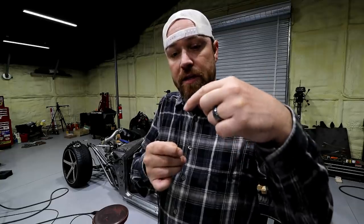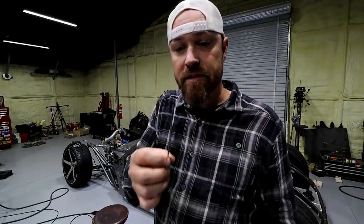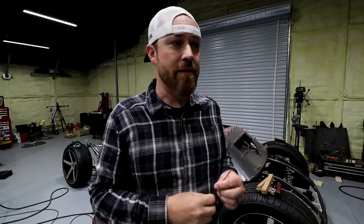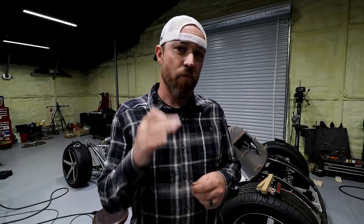The reason for that is because you don't want foreign metals on whatever you're sharpening your tungsten with. So if you're grinding all kinds of metal all day long on your belt sander or grinding wheel, you don't want to then sharpen your tungsten with it, because potentially you could embed those foreign materials into your tungsten — making it not as pure and clean as it needs to be to produce nice, clean TIG welds.